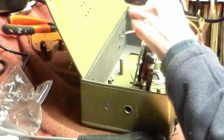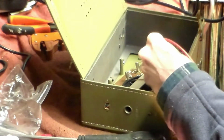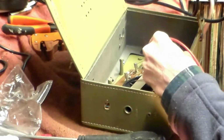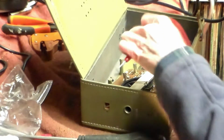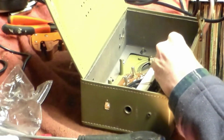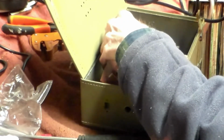Well, what I want to know at this point now is which part of it is which. The positive goes in the middle and the output goes to these two transistors. Okay, and from there now I've got 1.79 ohms to what I think is probably the base, and the outputs go, okay, so one of these is short circuit.